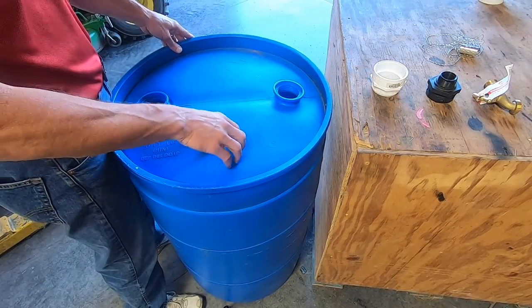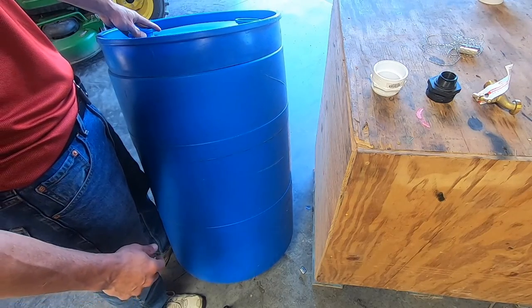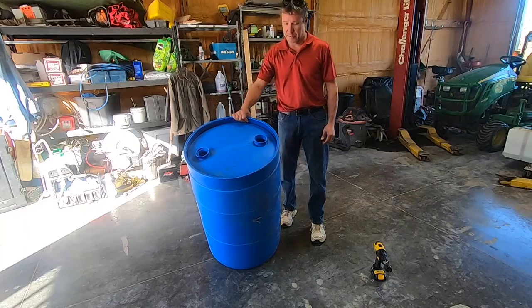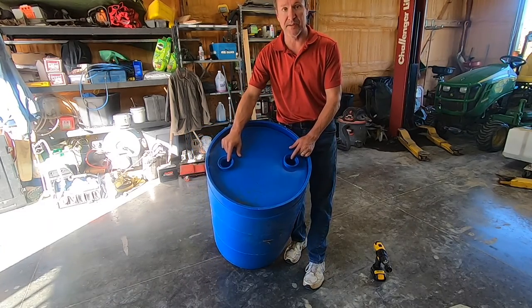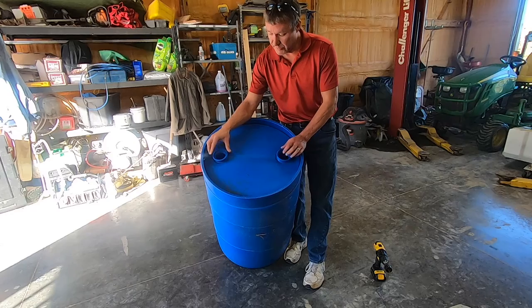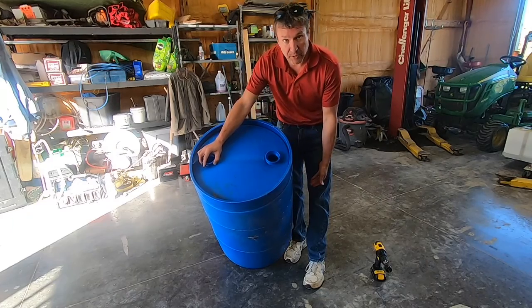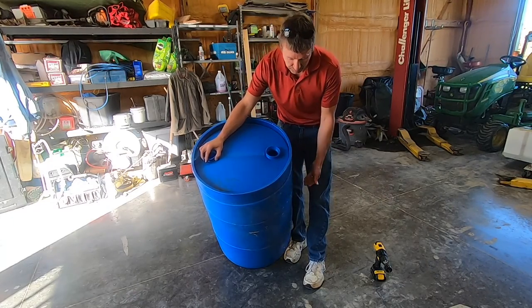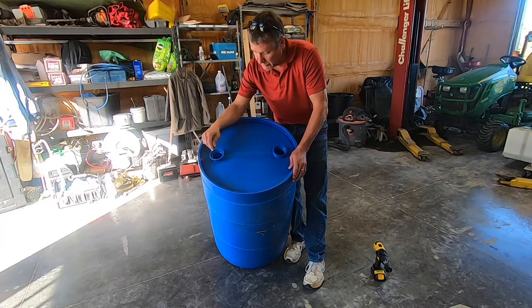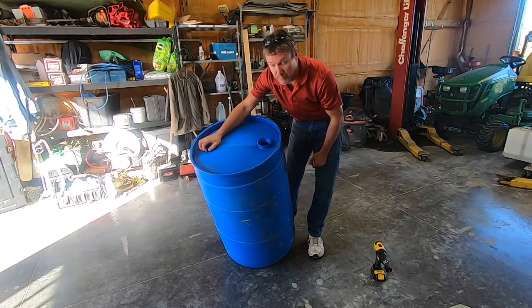We are doing this with a totally sealed top on the barrel — this lid does not come off. So this is the trick on how we get all the way to the bottom with the hole and get everything mounted. Now, before we start drilling, you should know that the two holes up top have two different size threads. One is your pipe thread that you can screw a fitting into; the other is an oddball size. So you need to decide if you're going to run your guttering into the side with pipe threads, and where exactly you want your hole so you can fill through your guttering.